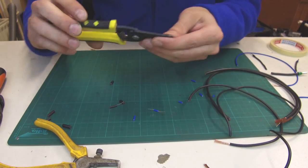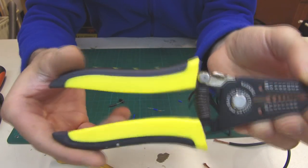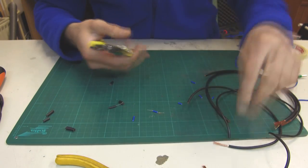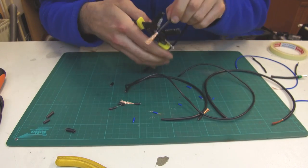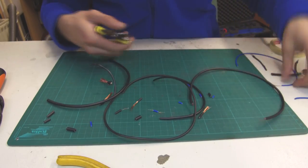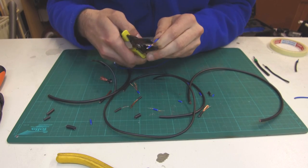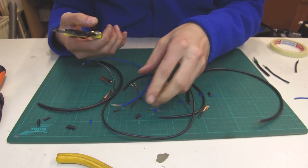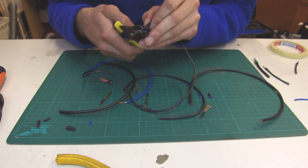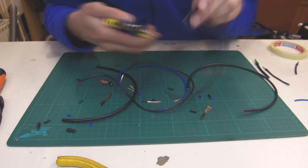Here I have another Chinese stripping tool for a few dollars. It has a pretty nice built-in cutting area. But the main stripping function is not so good — you must be very precise to put the wire in the right hole in the stripping jaws, which is very time consuming. Also you get less power in your hands with that tool position.